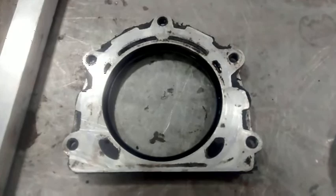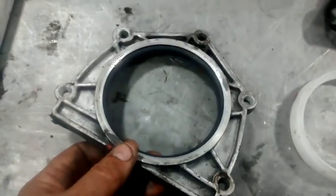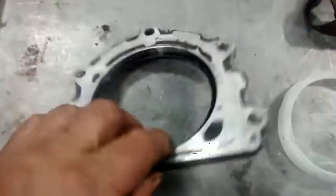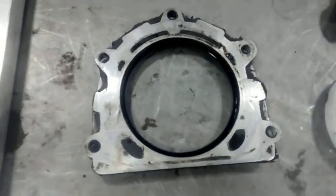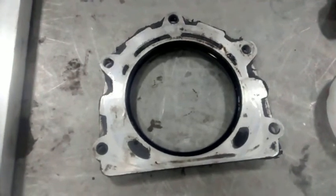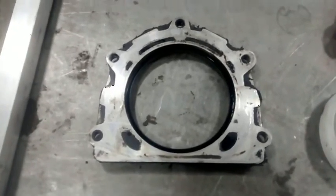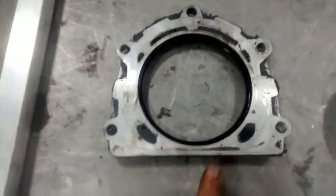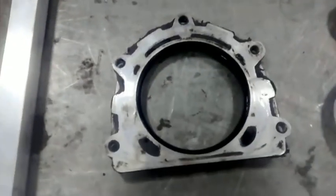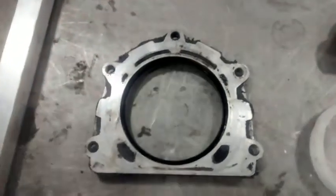Anyway, this is a rear crankshaft seal of a 300 TDI. The clutch was slipping really badly and I couldn't work it out — good pressure, high mileage clutch slipping. I put a new clutch in it, stripped it down, but I noticed under the bell housing just where this would be there's a bung. I took that out because normally that's the wading plug and you don't usually fit that when driving — but it was full of oil.